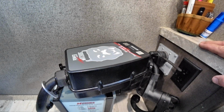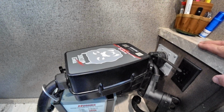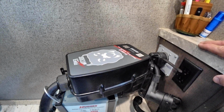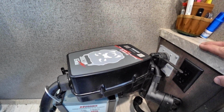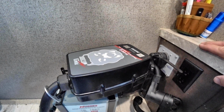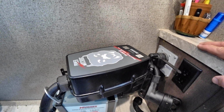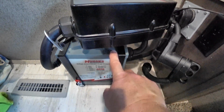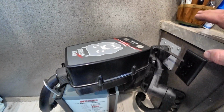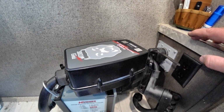The other thing is real nice, like in our case, it was late at night and the campground power went out, but we didn't know at first if it was something in our rig, if we had a problem with something in our rig, something out on the power pole, just us, or the entire park. And of course, I just opened the app and there was no alerts or anything like that. It just said power disconnected. Well, if the power is disconnected, then that means either the AutoFormer in our case had protected itself by shutting off the power, or somebody flipped the switch outside, or the power went out in the park on the pole. So it was nice to know.